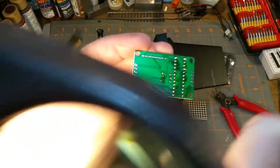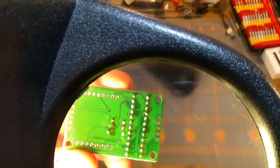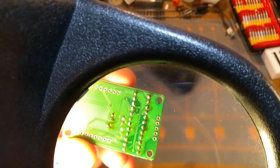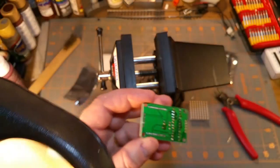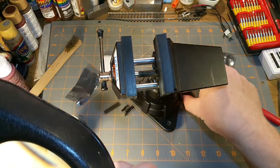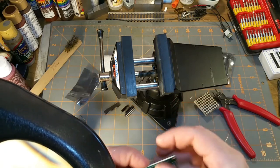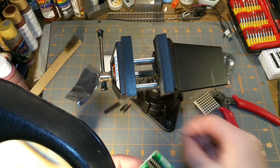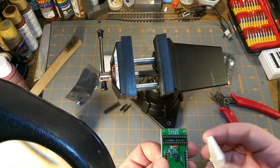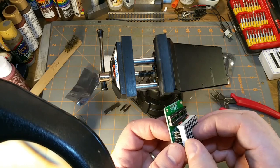Let's take a quick peek here. Yeah, everything's got solder, no bridges. Okay, next - the socket for the LED matrix uses these cool turned-pin headers rather than the cheap stamped ones like what the chip socket is made out of.